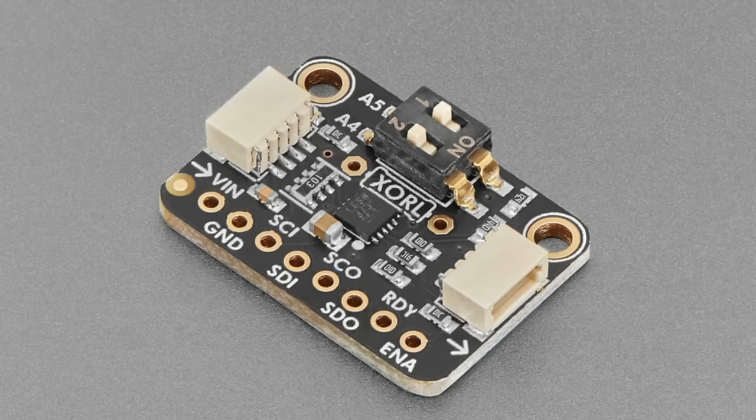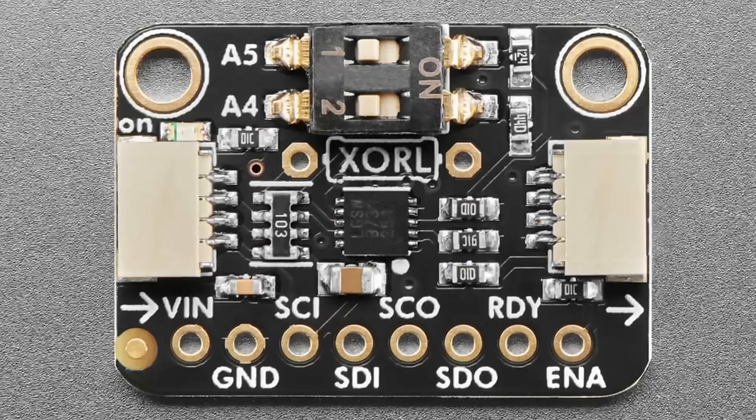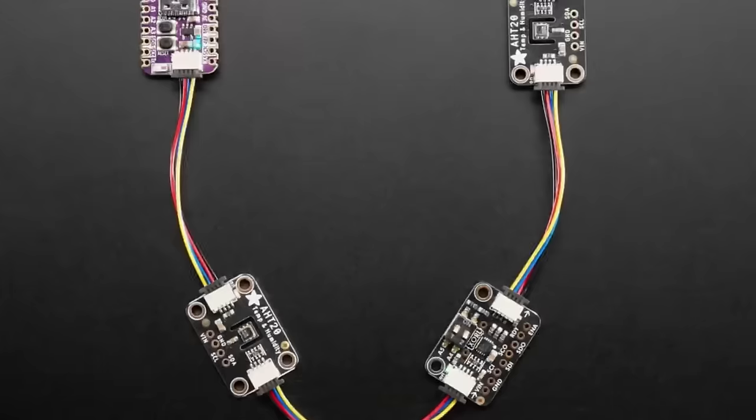This will be fixed in I3C but we're still using I2C for a lot of things. Sometimes you can use two I2C buses, but sometimes that's not possible either. The LTC4316 is the solution: the left side is the input port and the right side is the output port. It translates between the two buses — if it sees an address coming in from the left, it twidddles some bits before sending the address to the right. The controller sees a different address, but the device has no idea.